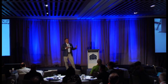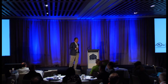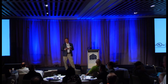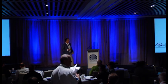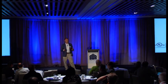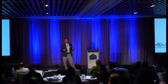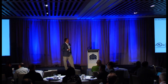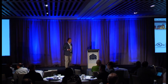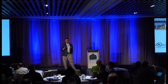And to do that, I'm going to take you back in history just a little bit through the development. This entire series of products that we continue to invest in every year with additional UL testing is developed under the UL 2079 protocol, which includes cycling of the joint system followed by the burning tests to determine the fire rating, and in the case of wall systems, a hose stream test to simulate the impact of falling debris during a fire.